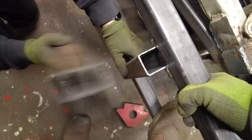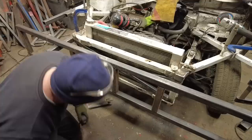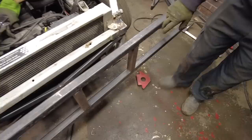I'd bring them out further if the cuts are over here. Yeah, a bit more. This one's 32. So that one's 28, so it could go out a bit. Just measure the same on the top as the bottom there, get your same cuts. Yeah, so if we square these, tack them in, then put it on the floor. Yep.